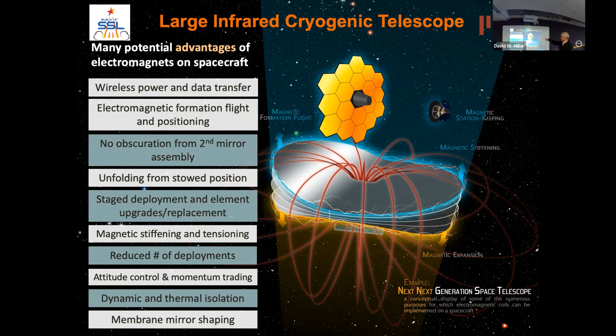You could electromagnetically trap the different mirror segments together to form the hexagonal pattern. You could mechanically sever the telescope's secondary and primary from the spacecraft bus, then impart forces and torques from the reaction wheels through electromagnetic effects. This means vibrations and spinning imbalances from the reaction wheels no longer ripple through to the telescope as wavefront error or line-of-sight jitter — you transfer only the forces and torques you want. You could also magnetically deploy and separate the multi-layer sun shield.